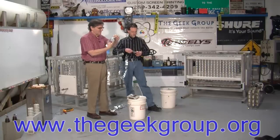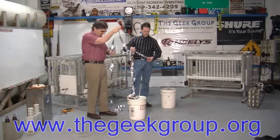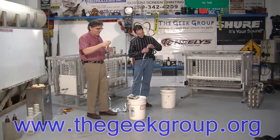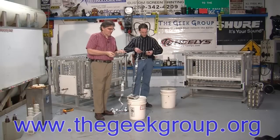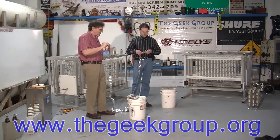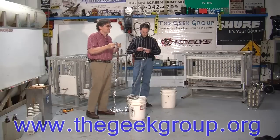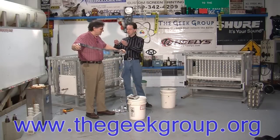Now, a standard capacitor is made the same way, with the multiple layers and the foil all spiraled up. But what they'll do is they'll catch the connections at the end of the roll. So any current that's going to flow through this capacitor is going to go into the end and go all the way through the length, and it's coiled up inside. Well, it's basically a coil of wire. It's an inductor. So you get an inductive reactance from your capacitor.